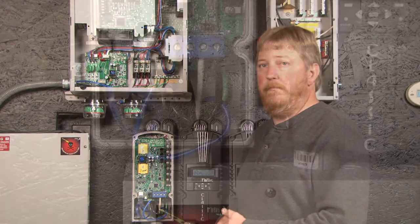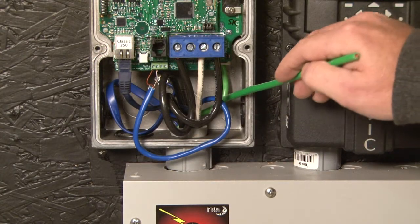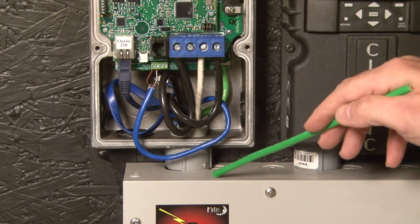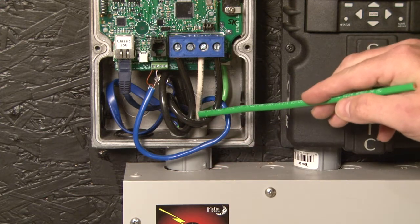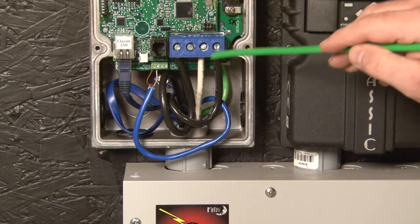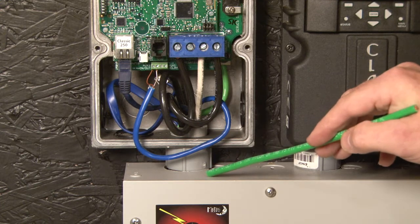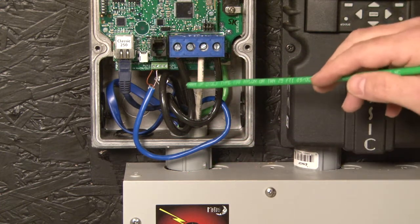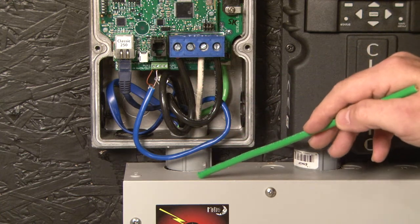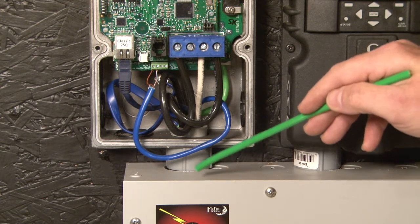I want to show you the wiring on the classic. Now we'll go into the wiring compartment. You'll notice we have a chassis ground or earth ground. This goes down through our conduit into our box into an earth ground bus bar. We have a DC positive input to the classic — this would be called PV positive, in this case it's wind positive. This goes down into this box into an overcurrent protection device and up into our clipper. We have a common negative, which goes down into a negative bus bar in our junction box. And we have a battery positive, which goes down to an overcurrent protection device in our junction box.